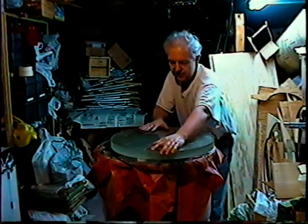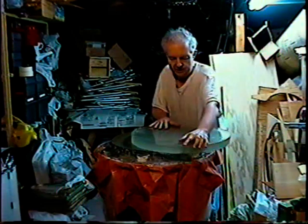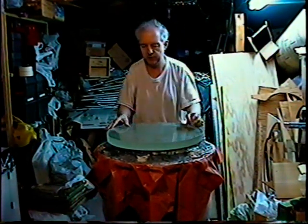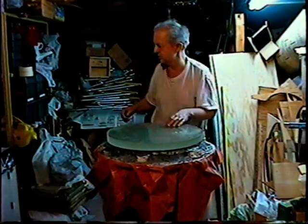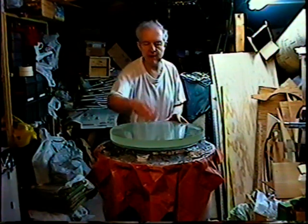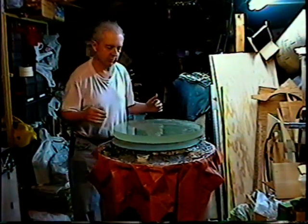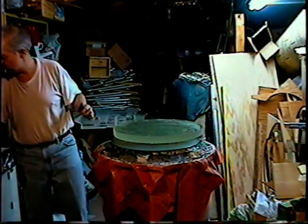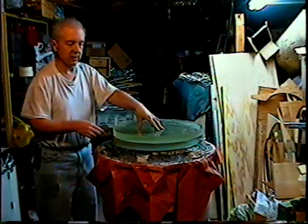Now that it slows out, I tend to go over to this side of the wall to give any abrasive on this side a chance to cut the glass too. You can see it doesn't last very long — you can hear that smooth sound. I always try to start in a new position, not the same spot each time, and I try to memorize relative to some object in the room where I start each charge so that the law of averages has the best chance to take place. Rather than lift this heavy thing off every time, I just de-center it about three-quarters of the way out. I could then take a damp sponge and sponge off the old spent abrasive — the muddy residue — and rinse the sponge off.